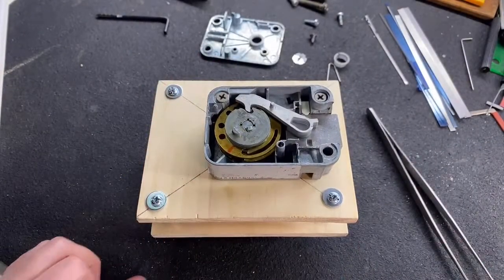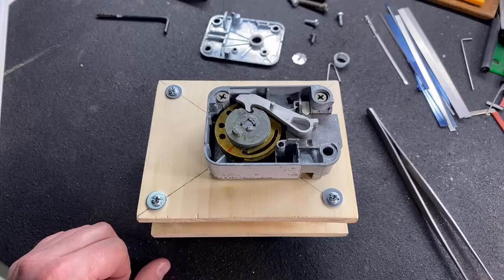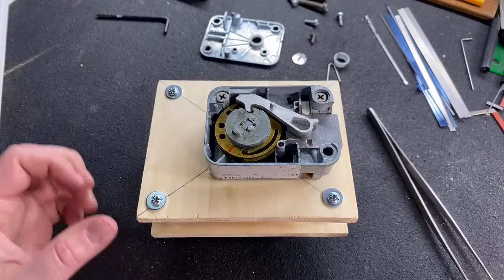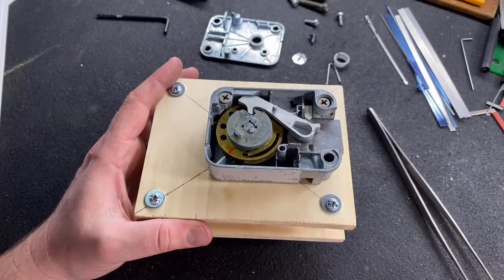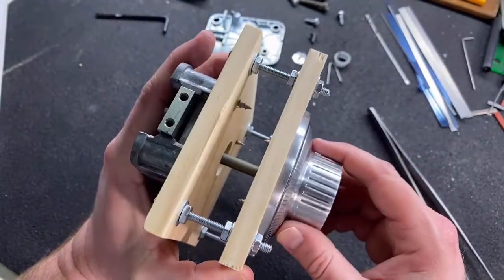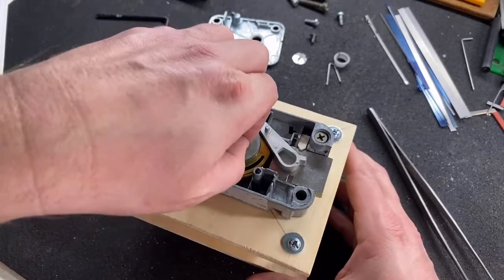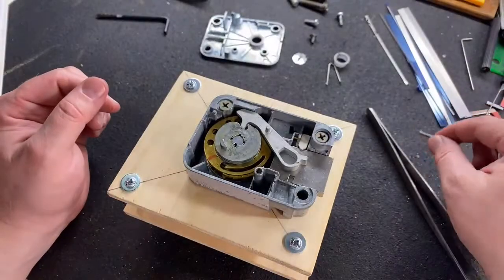Rune, that would be the only combination lock I can open without the combination then. Okay, G-Key, man. Yeah, I'm not looking to throw anything out at all. So yeah, I'll save everything. And I'm pretty happy with this mount as well. Because I was able to get it adjusted just right to where it would hold everything and keep it spaced. I was also looking. I know that the spline key, this won't work as a spline key. I realized that. So what I was thinking about doing is cutting down some of the spring steel and then just notching it like right about here to where it would drop in and not drop any further. It would take 2 pieces of this to make the correct thickness.